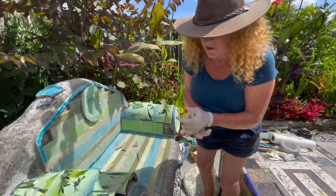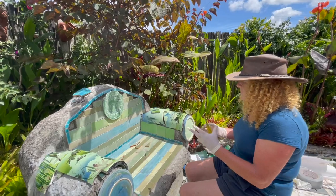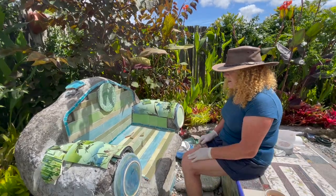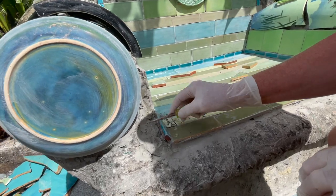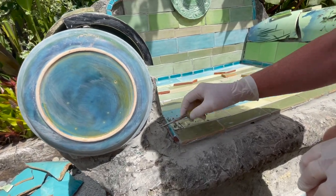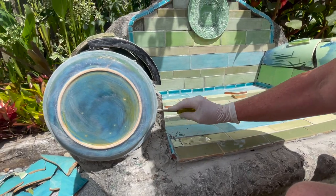I can't find my screwdriver. Right, so I found my screwdriver. I just want to explain to you that there's a working time with the concrete adhesive. You know, it's not a full day yet. I can still do this. Which is pretty handy, because tomorrow I won't be. That'll have set as hard as concrete tomorrow. Yeah, make sure you don't leave it. It just saves your job later on.